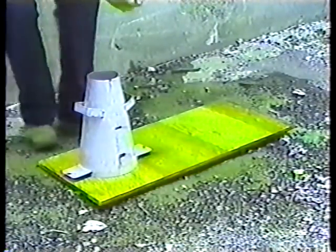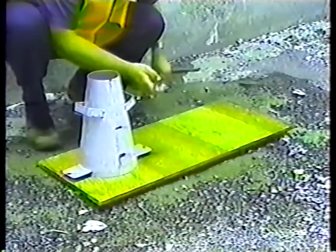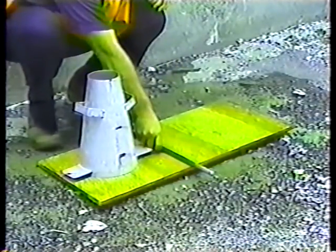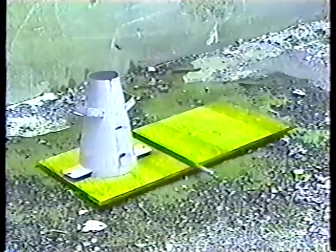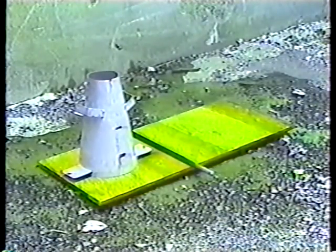Third, the tamping rod. Make sure it's the standard rod, made for concrete testing. It's not acceptable to use a cut-off reinforcing bar instead. The rod has to have a rounded tip, so that the large aggregates aren't pushed to the bottom when the concrete is being rodded.